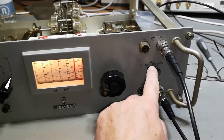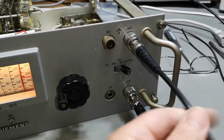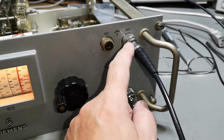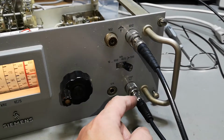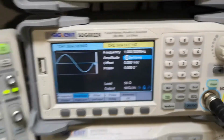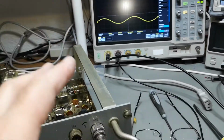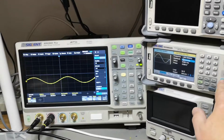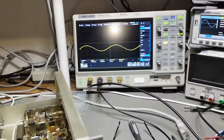See, here's how this thing actually works. So this is the antenna input. I just put in 1 megahertz. In this setting, I just use the internal preamplifier, a wideband preamplifier, and then I get a factor of a lot more input. Look at that. Just, what is that, 10 millivolts? And look at that, 200 millivolts per division here, right? So anyway, this is the preamp version. Let me try and turn the output on and off. See? I'm not lying. It's coming from here.